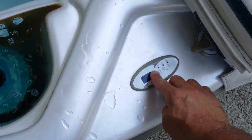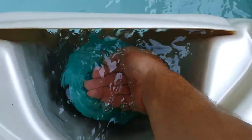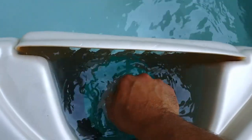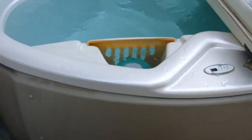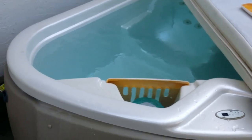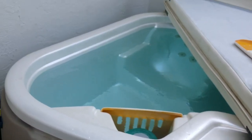I'm going to turn the pump on high. Before, when I put my hand over here, you would feel really bad suction. Right now there's barely any suction, so now I put my cap back on and my filter has now been cleaned. I have to do that once a week — or every other week if nobody uses it. That's how you clean your filter.